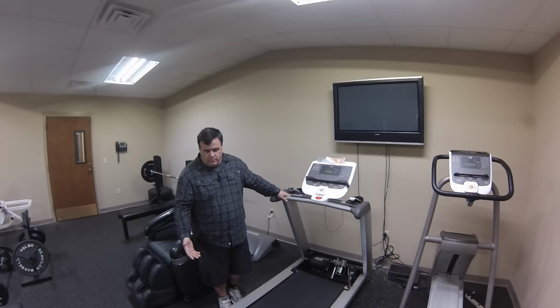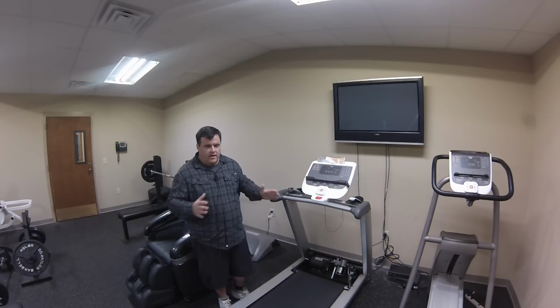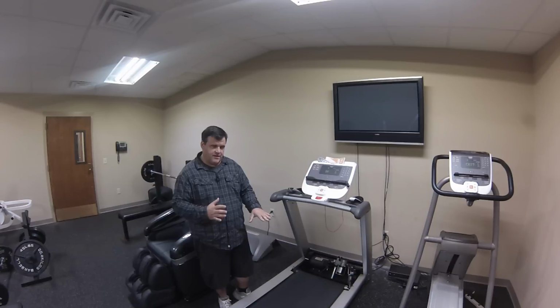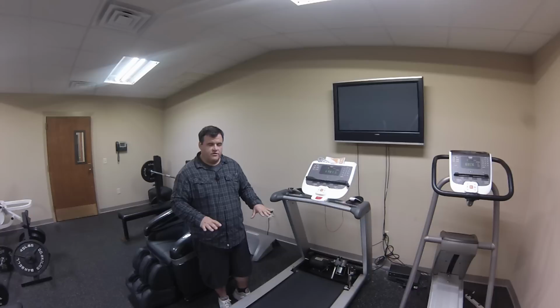Another possible culprit is a loose walking belt, which can easily be fixed at the rear roller. Now, you can have a bad belt and too much belt deck friction, and tighten your walking belt to create more tension, so that friction of the belt and deck doesn't stall the walking belt. You've just added to the problem. So try to be very thorough in isolating these potential failures.